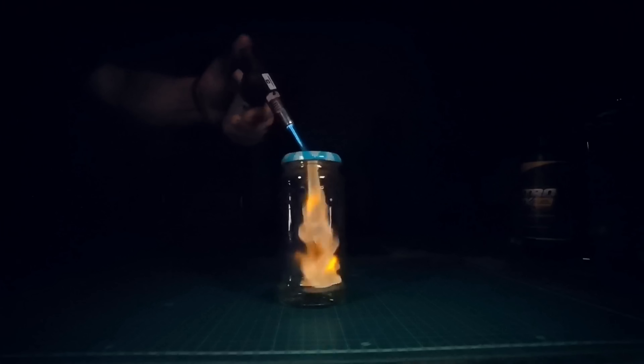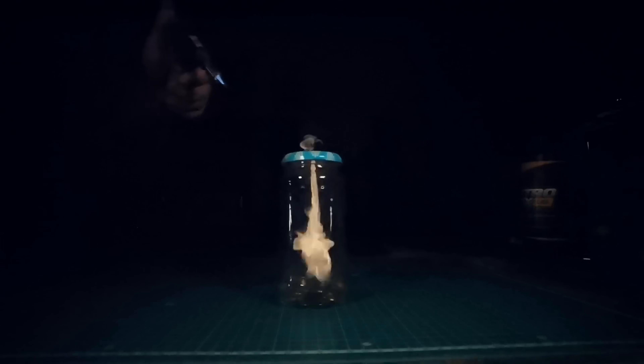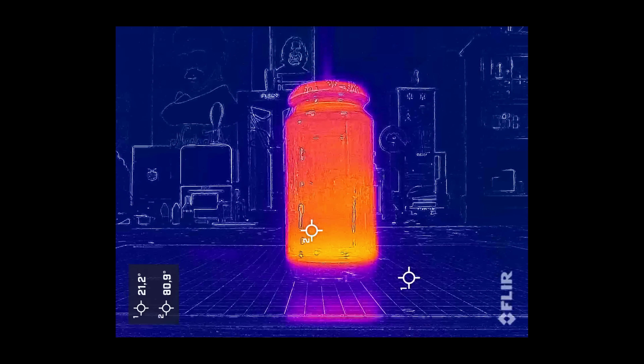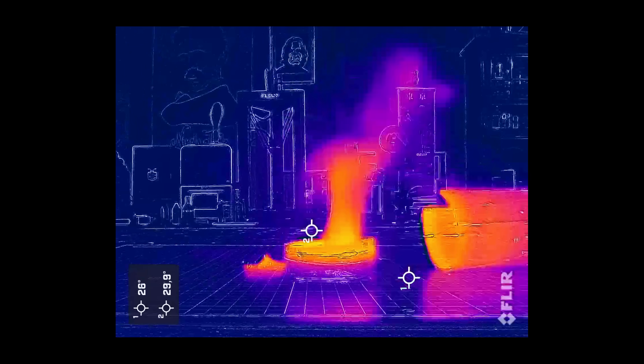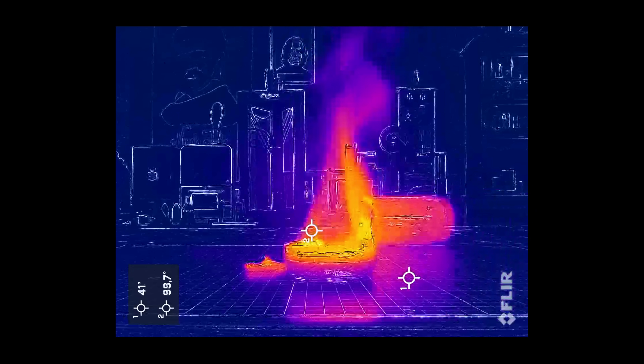This is what is called the Jam Jar Pulse Jet, and it uses the same effect as before. The alcohol fuel mixture burns, expands, cools down, contracts and pulls more air inside, which inevitably mixes with more alcohol and burns again. If I let this run for long enough, it gets so hot that eventually it breaks. This jet engine gets pretty hot — and yes, this is a jet engine.